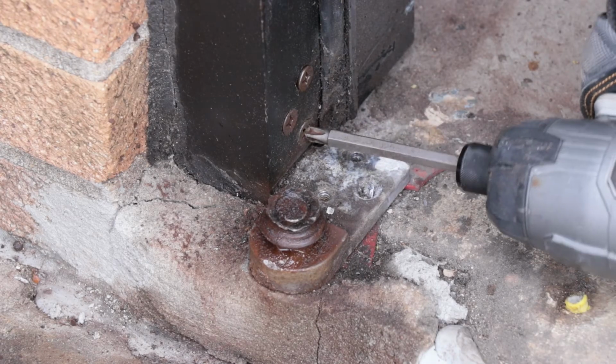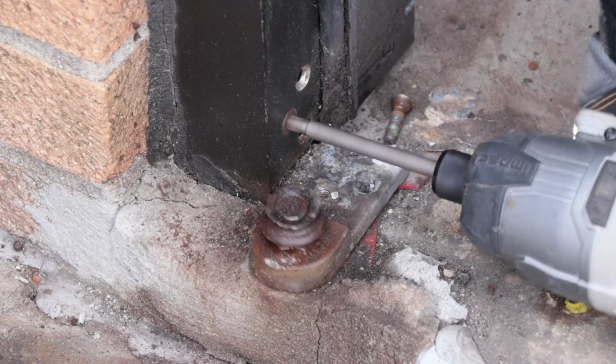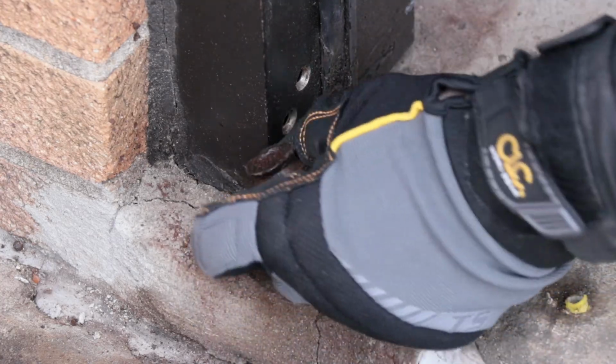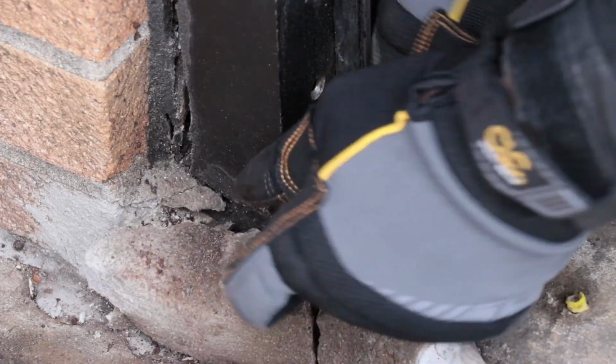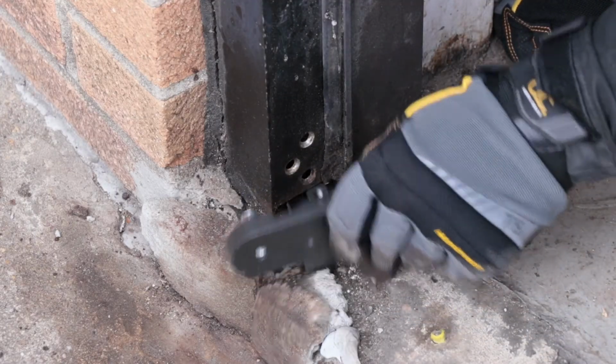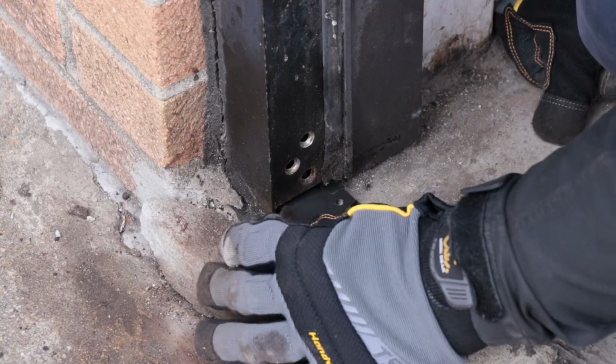The lower pivot has a leg that goes up into the lower side of the frame. You'll need to remove these screws. Slip the pivot leg out of the cutout in the frame. Install the new pivot, then reinstall the threshold.